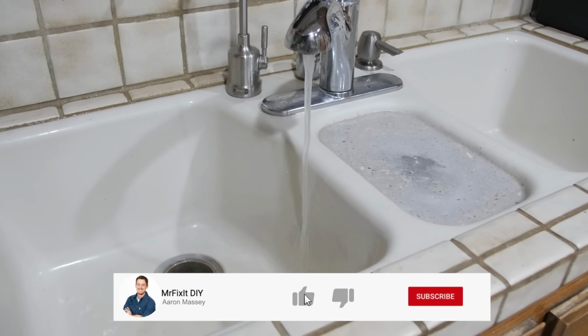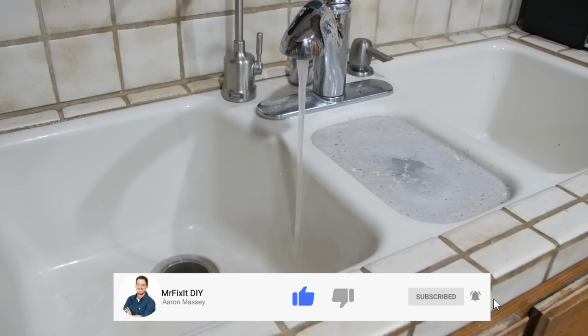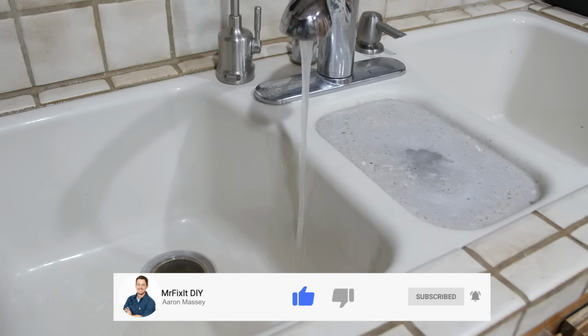First of all, if you have another sink in addition to your disposal, make sure the water drains from that drain to isolate the problem and make sure the issue is tied to the disposal itself. If both don't drain, there's likely a larger clog going on farther down the line that will likely need to be worked on, and the disposal itself is not clogged.